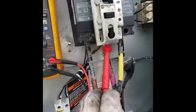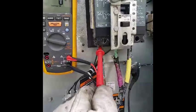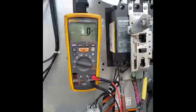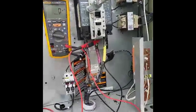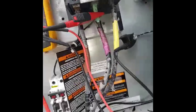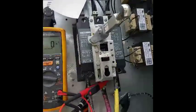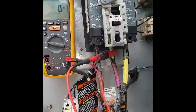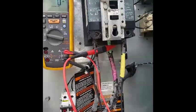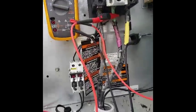Got the power killed to the unit. Take it off and clean it up. I'm sitting here thinking I need to cut these wires back maybe two or three inches, but if I do that I'm not gonna have enough wire to reach those lugs — because it's already tight and you can see where it's bulking up. So I'm going to request they get an electrician out here. They're gonna have to run some new wires or work his magic, because I know if I cut it I'm not gonna have enough to reach it.